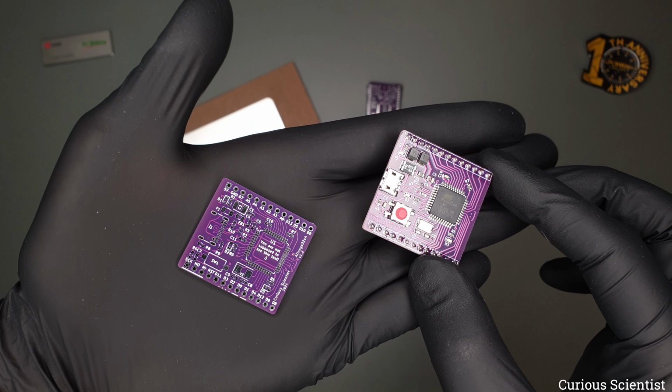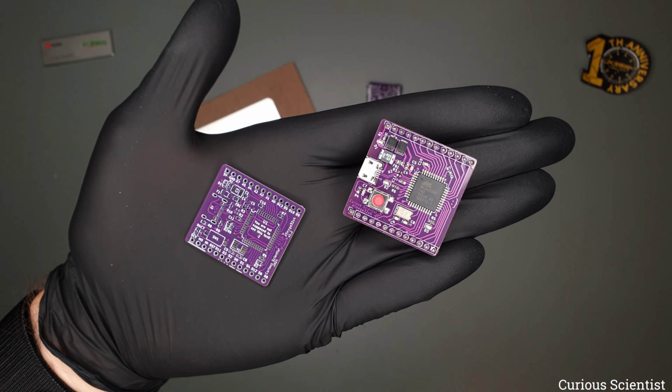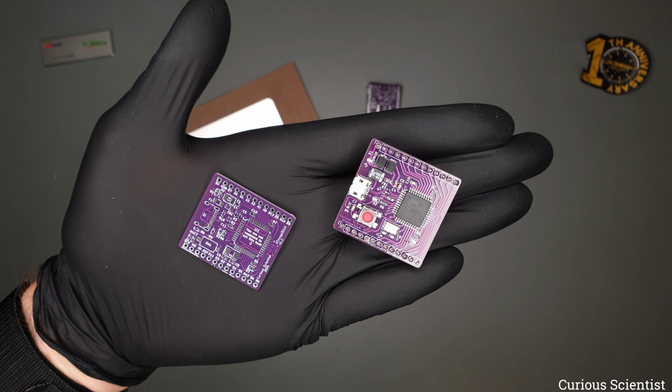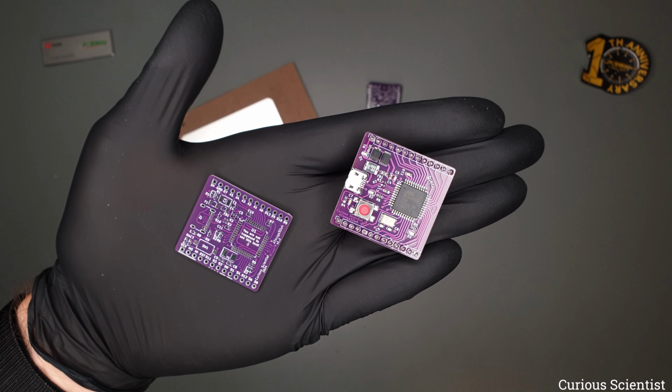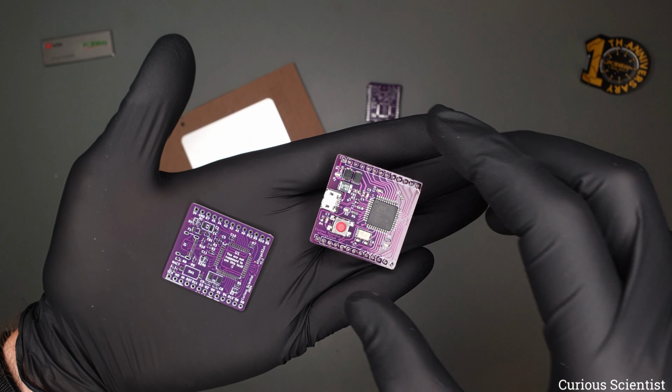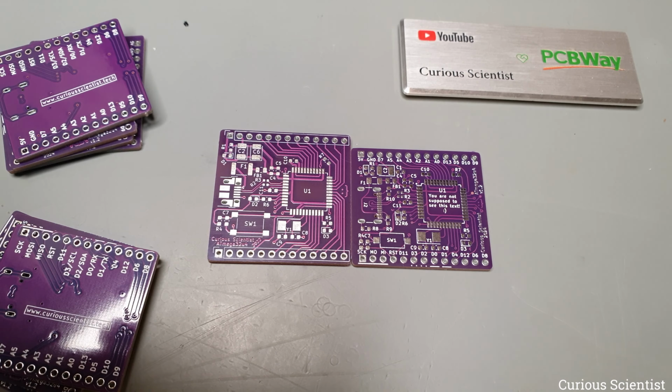custom keyboards. When placing the two printed circuit boards face to face, the first update is already visible. The new board is slightly narrower. With some careful component placement, the board became narrower by one pitch of a jumper header, or 2.54 millimeters. So now it actually fits in a regular breadboard, but the wiring has to run under the board because the PCB covers the whole breadboard edge to edge.